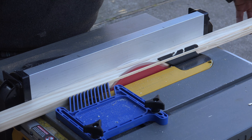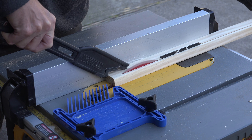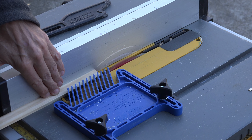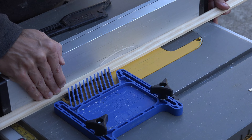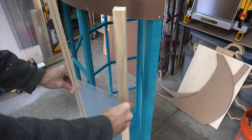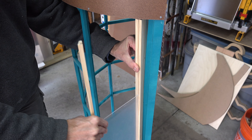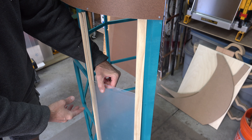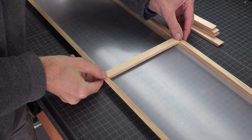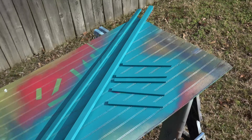At this point, I needed to start making my window pane door, so I took a strip and cut it at an angle on one side. This would allow it to be flush with the pane strip already in place, so these cuts are slightly angled. When cutting the glass groove, I had to slightly angle the blade again so the panes would stay angled and the glass be in alignment with the other pieces. For this part of the window, I used select pine — it's a little stronger than cutting it out of 2x4s. I then slid some plexiglass in the groove and ensured it would fit. I cut a few cross pieces, checked their fitting, then pulled the plexiglass back out and took them to the painting table for a fresh coat front and back.